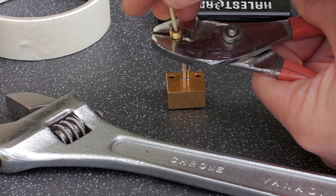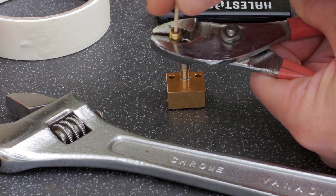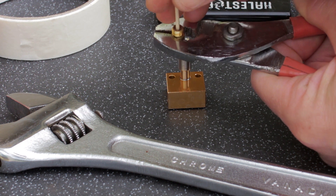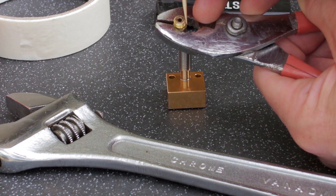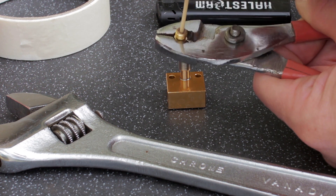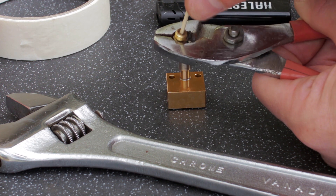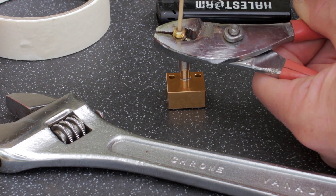Eventually it will pull out all of the filament, and I've managed to completely clear this entire nozzle using specifically that method. So I was quite pleased with that, and I thought this might be a tip that might help some of you others. And obviously being wooden, it's not going to do any damage internally to the nozzle, unlike a hardened steel drill bit for example.